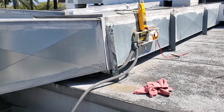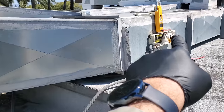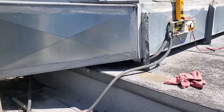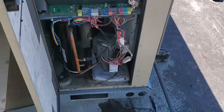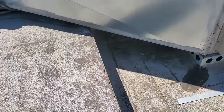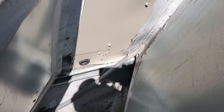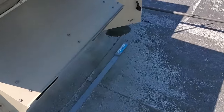Everything else was happening inside the detectors. What I'm going to try to do is harvest the red-jacketed wire, and if I have one long enough I'll use it to run in that conduit right there — it goes directly to the AC — and we'll use that temporarily. Now I'm not going to say who the installing contractor is — you guys know who you are because you watch my videos. It's kind of ridiculous: checking out this thermostat wire going from the duct detectors and they just shoved it into a hole in the ductwork and are just running it through the unit.